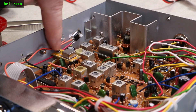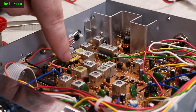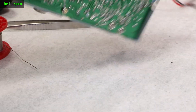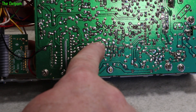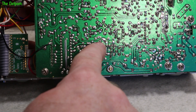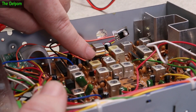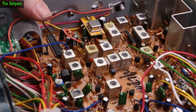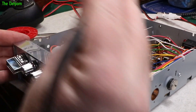I've mounted my board in here. I've got a standoff mounted on the hole — there's already a circuit board there. I've removed the capacitor one end, which goes from that side. It comes from that inductor there, comes along, there's a solder pad just there, the capacitor goes between those two. Lifted that one out, brought it up, put an extension onto it — a little lead — comes up, around the back, goes to the board on the output of the board. Let's do some more. I've got to solder that in now — it's not quite soldered yet.